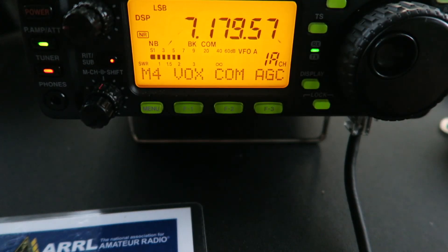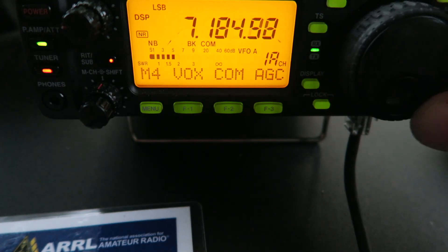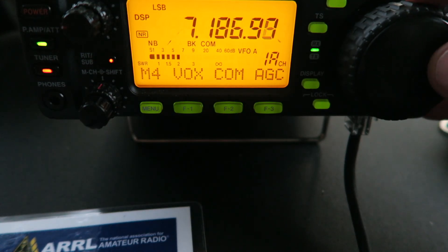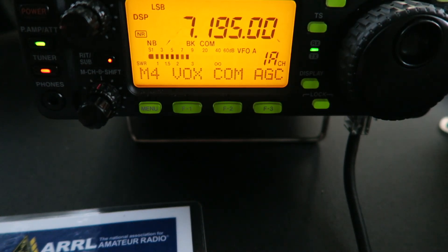Okay, so I got the antenna to tune at 7.200 MHz on 40 meters. I had to add the third rod, had to lower the coil all the way down to the bottom of the loaded coil, and had to extend the counterpoise out to about 35 feet. I got to about a 1.7 to 1 SWR. I should have recorded the analyzer reading but I didn't. I tuned it at 7.200 MHz.